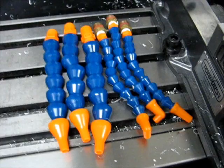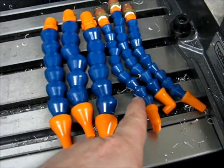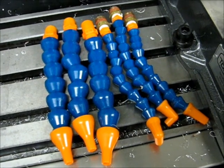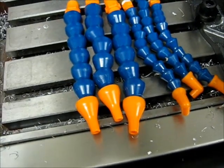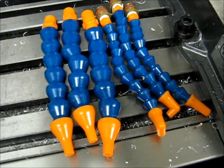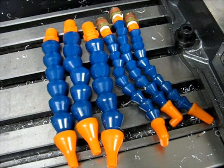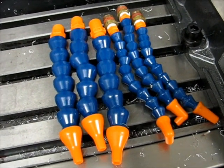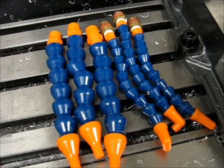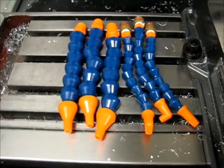My estimate is this is going to flow 500 gallons per hour. The previous setup flowed about 295 gallons per hour, so from what I saw, this should flow up around 500. The pump — I don't remember exactly what it's rated at, something like 1,200 gallons per hour. So with the lift height of about 5 to 5.5 feet, that seems like a reasonable loss, especially going through all the system that it's going through.